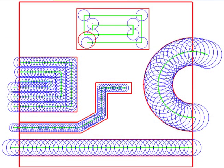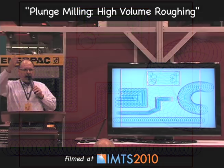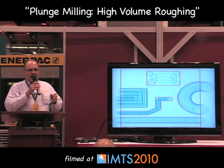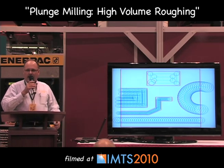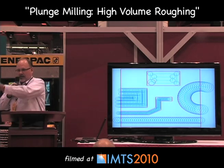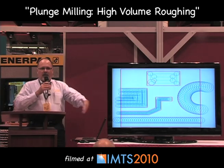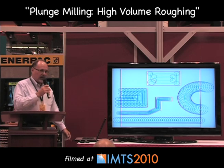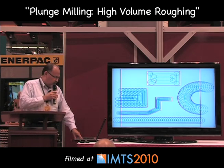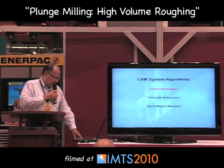This is a typical example of a footprint after the fact of what a plunge milling routine would look like. There's an awful lot of strokes there — a lot of up and down and repositioning. But the repositioning is minor. When you talk about traversing through something, coming back to the beginning, and traversing again, there's a lot of wasted motion. Whereas in plunge milling it's very much to the point — step over a couple hundred thousandths and do it again.